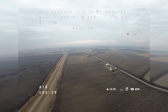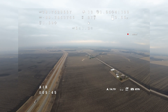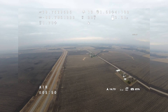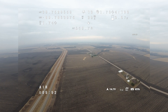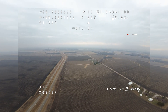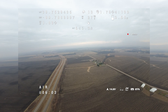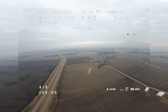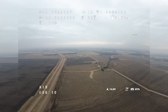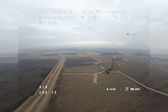You can see I've climbed back up to 600 feet, so I'm a little higher, which brings my link quality back up and my megabits per second back at least into the 20s — that's fine. So here we are at 1.7 miles and my battery is at 3.68V. I'm using a lithium ion battery pack, it's a 2,600 4S. I'm not worried about this voltage yet — I'll usually take them down to about 2.9, I'd like to be landed by then, 2.8 even. So plenty of battery here.